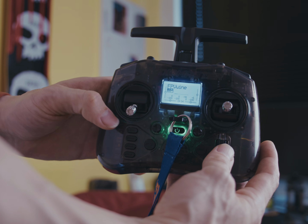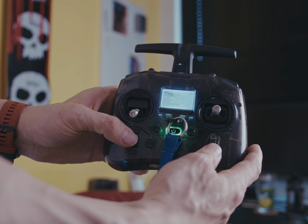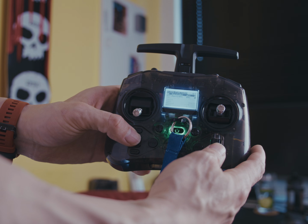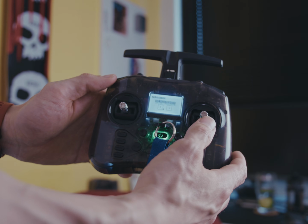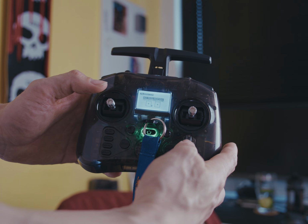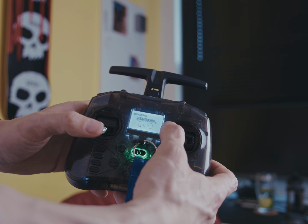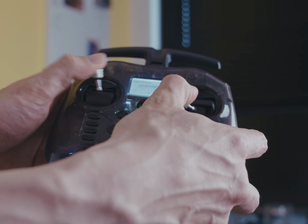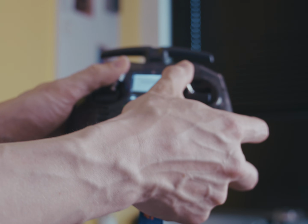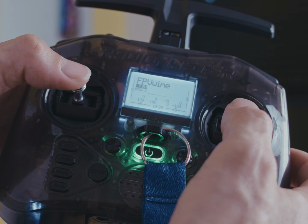throttle warning. You want to go in and calibrate it. So it is in the system menu, and we want to go across, cross, cross, cross, cross, cross, calibrate. Enter, and then it says set axis midpoint, which is what I wanted to do really. And then it says move axis around, so you just move your axis around. And then back to the center and escape, and now all good.